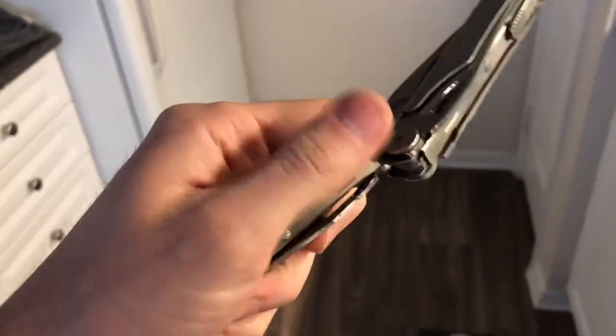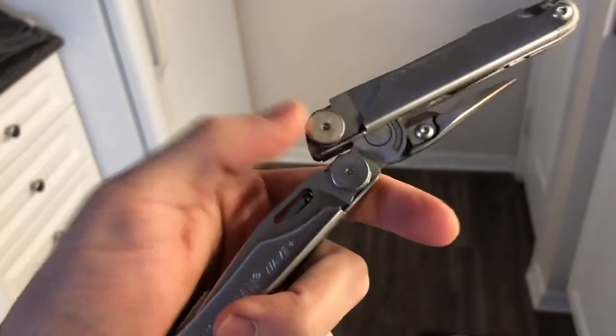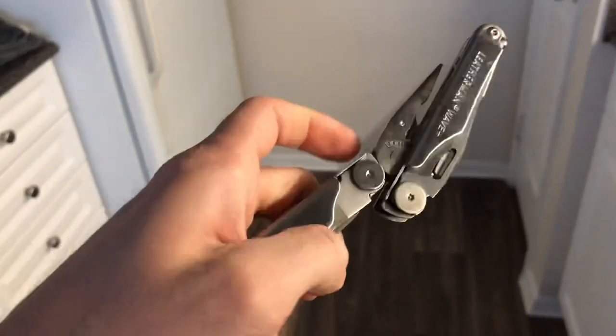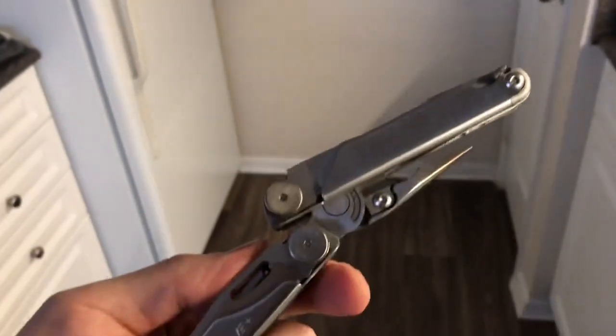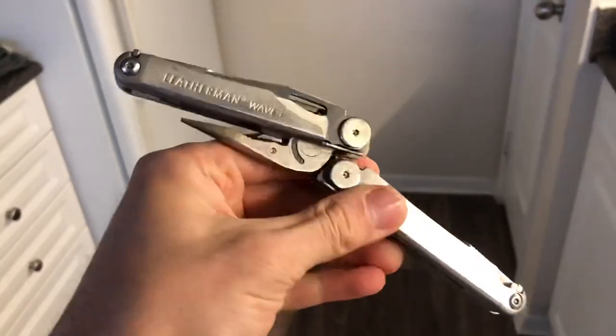So I'm gonna do another round, heat it up, not to the point where it's red hot, just so it'll start smoking a little bit from the oil that was on there, and that's the point I'm going. This may be degrading the hardness of the steel, but I really don't care because this tool doesn't work if the handle can't open. So, you know, if you've got a problem with it, I'll see you in the comments.